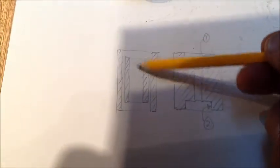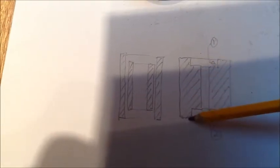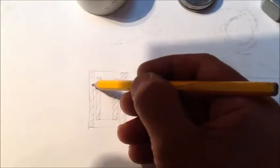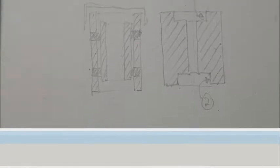What I came up with is constructed using two water pipes — one fits inside the other. One is shorter, corresponding to the inner part of the pivot, and one is longer, corresponding to the outer part. The only issue is there's about a millimetre gap all around the internal water pipe. To get around that, I ended up drilling holes through the outer water pipe — about a 10 millimetre hole — and then welding all the way through to the inner water pipe, which held the pipe in place.